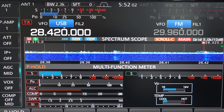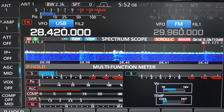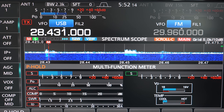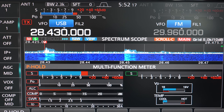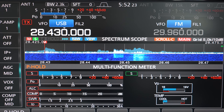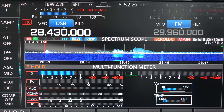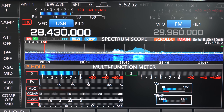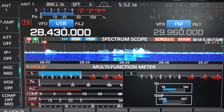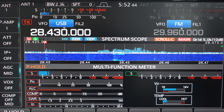What a beautiful band for a rag chew. You might pop on 2 meters for a rag chew, but as we've gone across here so far no one's shouting out 'five and nine thank you, five and nine thank you' - they're all having a lovely little chat on 10 meters. 28.500 is noted as the calling frequency for the 10-meter band. If the band seems fairly quiet, someone might put a call out on 28.500 and then move from that frequency. It's a good indication if you want to see if anyone's calling.